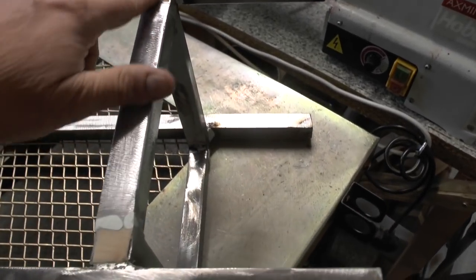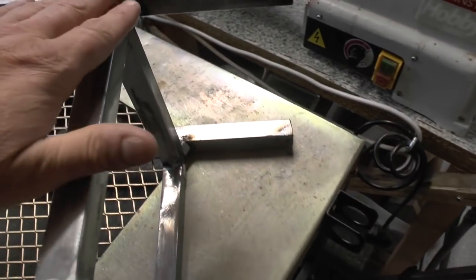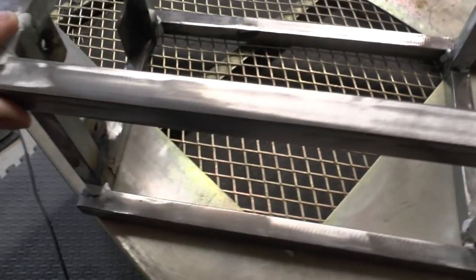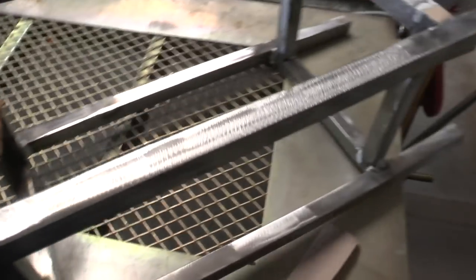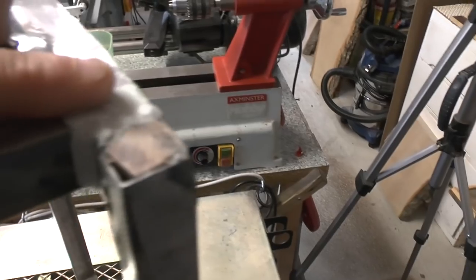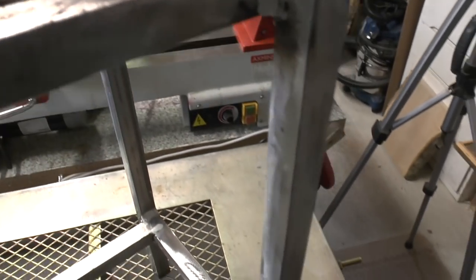The purpose of this milliput, which I'm going to be sanding down by hand now with 120 grit, and I'm going to sand the whole framework, is to fill these little porous perforations where I might have blown out a little bit, and then I filled them with weld and plugged them, but there were still some imperfections. So it's just a case now of smartening things up, and I'm doing my best. It's coming on, and I'm pleased with how it's feeling, and it all holds together.